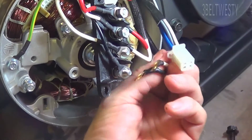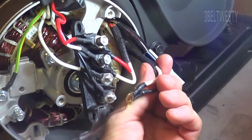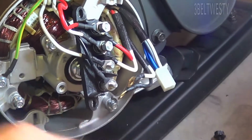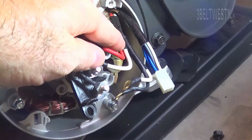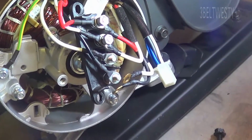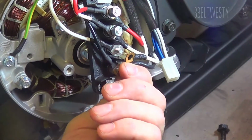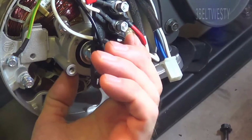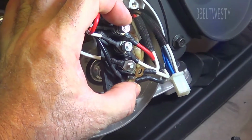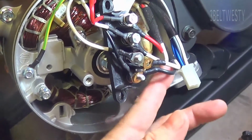These are the wires that come off the stator. This pair has a sleeve around it, white black. You get 110 volts across that. The other pair has a sleeve across it, red white. You get 110 volts across that. Normally this is hooked up so that the two whites are connected together, and you get 230 across this, 240, 110, 110.